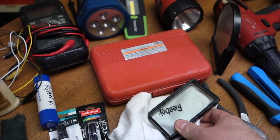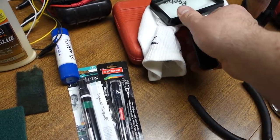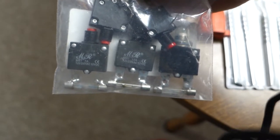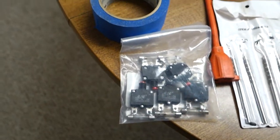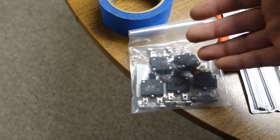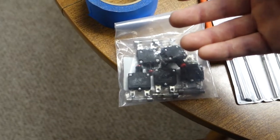Security bit set — it's also a regular every-other-type screwdriver bit set. These I made: circuit breakers mounted to fuses. You can use these for testing machines — like if you're blowing fuses for some reason, put this in, check out whatever you did wrong, turn the machine on. If you don't blow the fuse, you know you fixed it; if you blow it again, you know you've still got something to do.